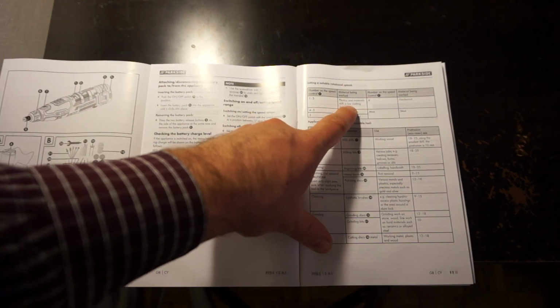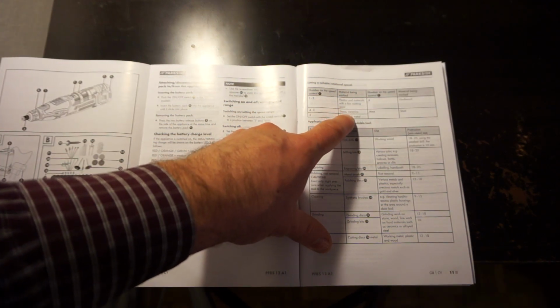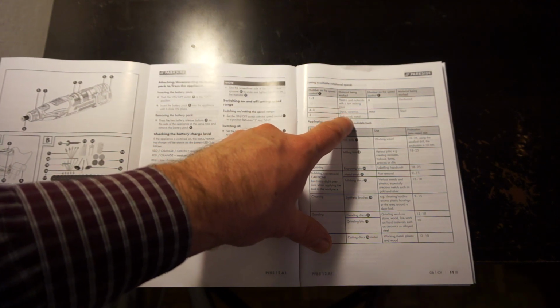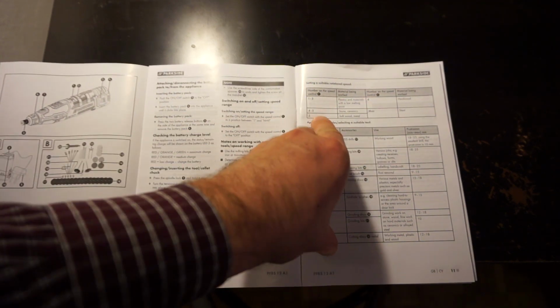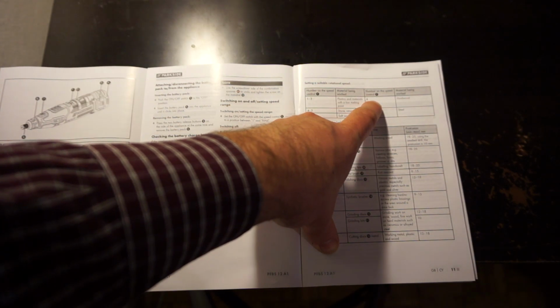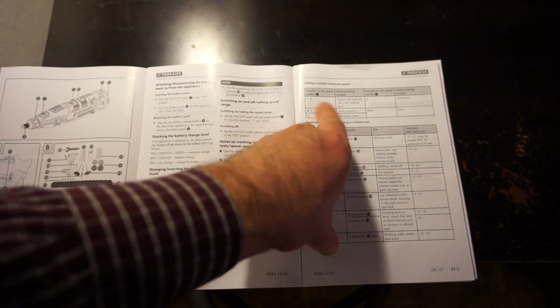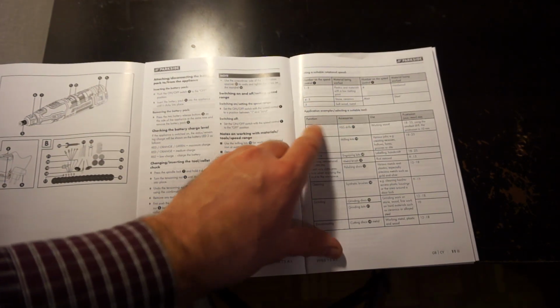or 6. Which speed you use? Slow speed for plastic or materials with low melting point, medium speed for stone ceramics, faster for softwood metal, that's 5, 6 for hardwood, and maximal speed for steel, so it's actually 7 steps. Application examples.